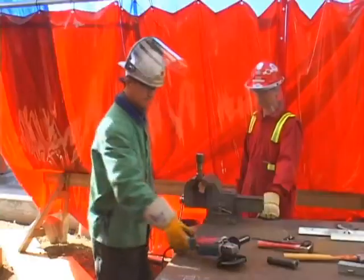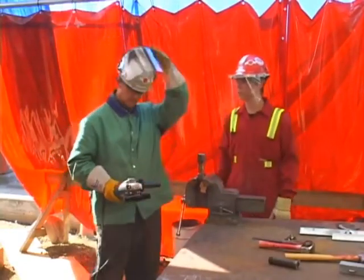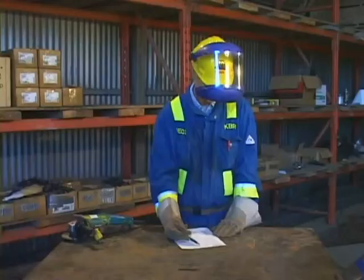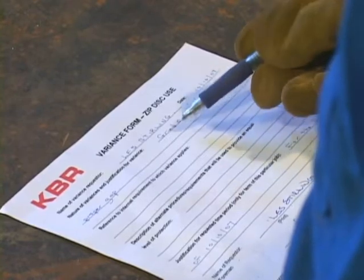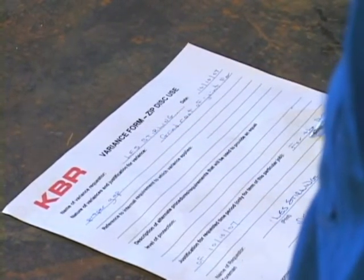If you see someone unsafely operating a grinder as a cutting tool, stop the work process, then take the time to coach them in the correct behavior. Because they are so dangerous, some companies may require a permit to be issued before allowing use of a zip or cutoff disc. Check with your supervisor to identify site or company requirements.